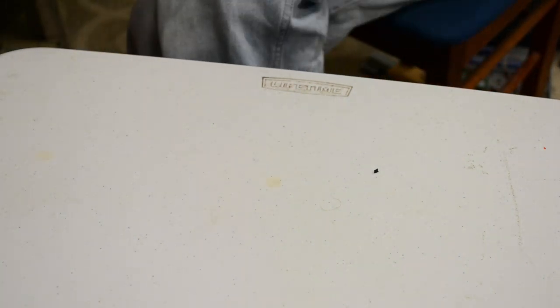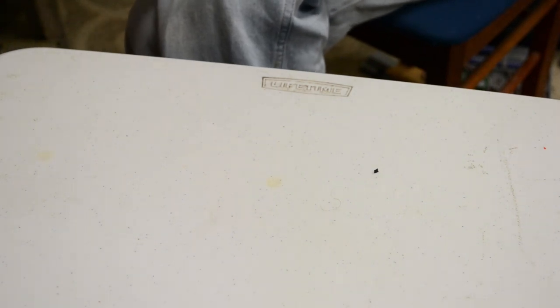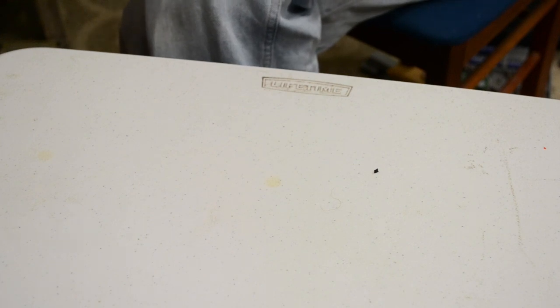Now, 542A was designed as an in-between. ARINC 542 is for foil recorders, the old recorders with the foil that it would scribe lines on. In the 80s, the FAA mandated that all planes had to have them scrapped and replaced with digital recorders. That was a fairly expensive retrofit for the airlines, so basically 542A was developed, which let you put a digital flight recorder in place of a foil recorder without actually having to redo anything.